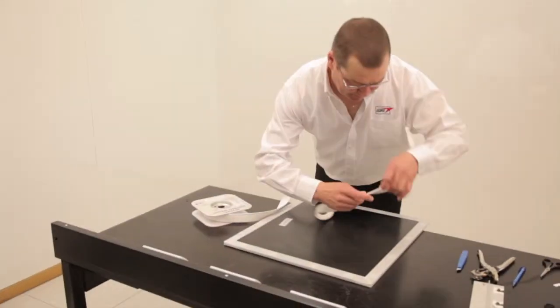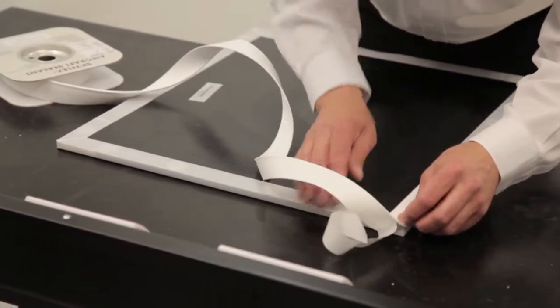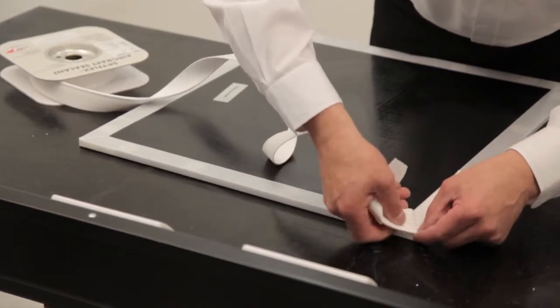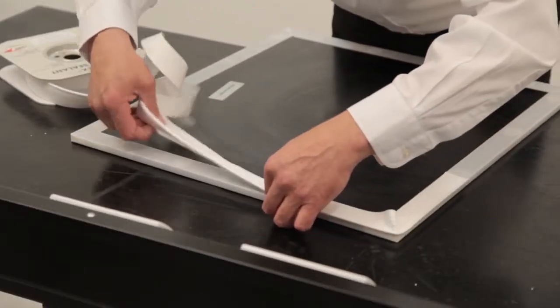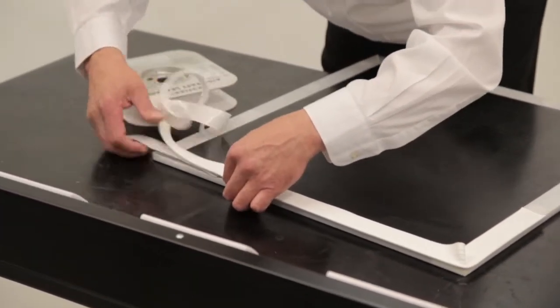Environmental sealing. SKYFLEX floorboard sealant tape is supplied with a pressure-sensitive adhesive protected by a release liner which should be removed during the assembly process. The big rib should overlap the board by 2 mm. As with all SKYFLEX, the tape should be laid flat and smooth without stretching.